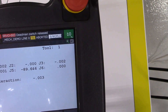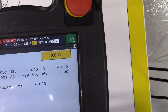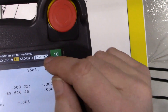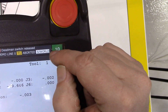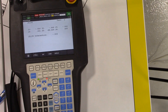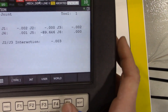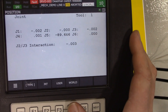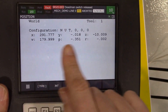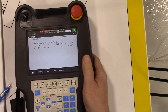How I switch between joint mode and world mode is to press the coordinate button. I'm pressing that now and you'll see it going from joint mode into world mode. The most common modes I jog in would be joint and world — I typically don't use the other ones very much. So pressing the button goes to world mode, and it shows up on the teach pendant indicating world mode as well. I'll also change the positional data display by hitting the F4 soft key so that it shows in world mode too.